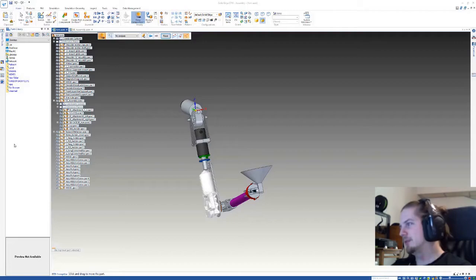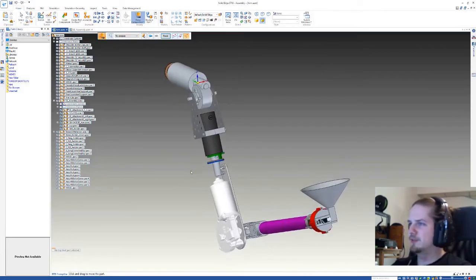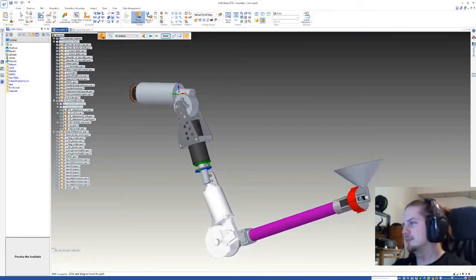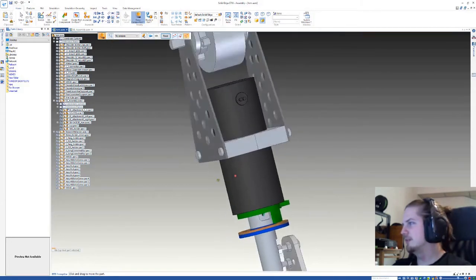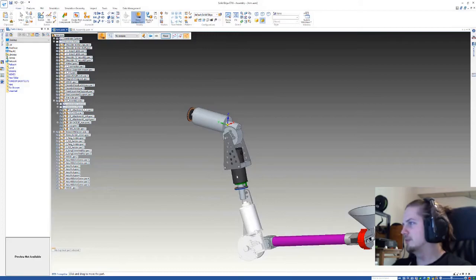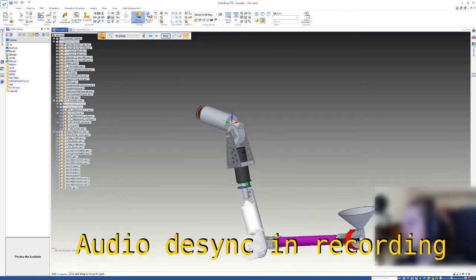So a good place to start within projects like this is the CAD. And for this, I'm using Solid Edge due to its availability. And there are some obvious benefits to why I want to use a CAD software. Like for example, it's to check so that all the fittings sit correct, so you know how to mount the whole thing, and so that you can check that all the parts that you want to make are manufacturable.